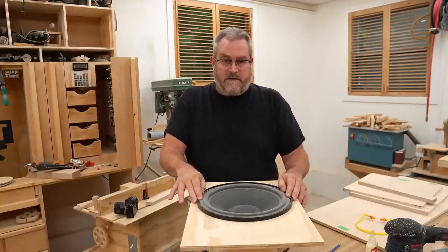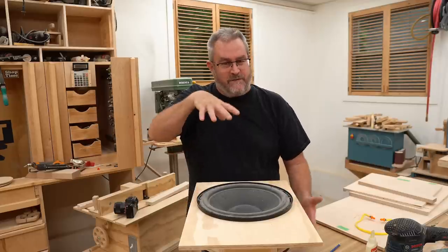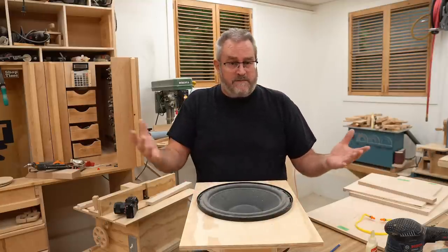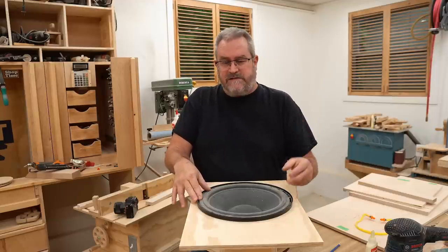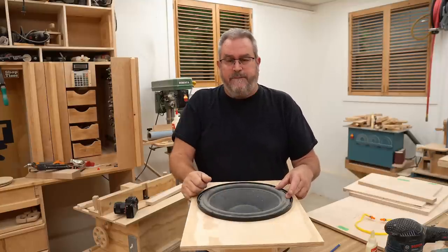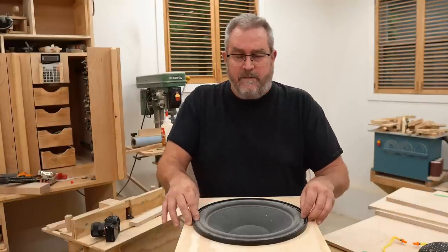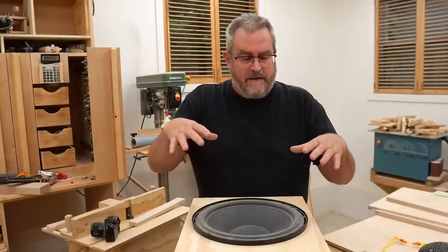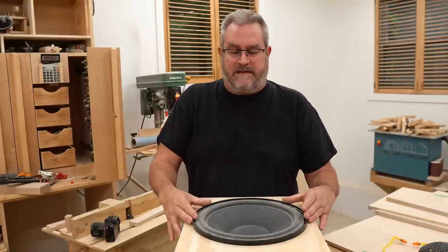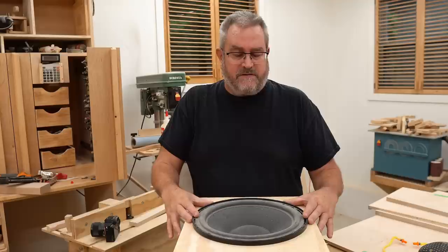And what they've been doing in recent years, in essence, is taking the attributes of this isobaric arrangement, these two woofers together like this, and putting it in one woofer so they'll work in a smaller box. There are two chief ways to do that. The first is to increase the moving mass, which is the weight of the cone. The other way is to increase the stiffness of the suspension. When you look at it realistically like that, you're not making any compromises by doing this. This is not a solution that's sloppy or going to produce bad bass or slow bass or anything like that. Really, what you're doing is just matching the stock drivers that you can get today by doing this with two of these older woofers.